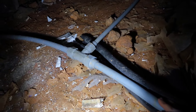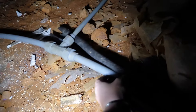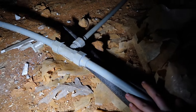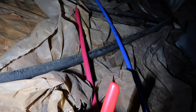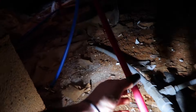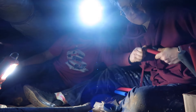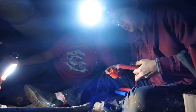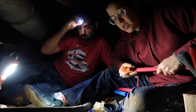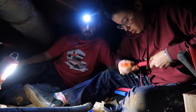This piping is what I have coming from the water heater that was feeding into the copper lines, and it also goes that way towards the washing machine. This is what I'm going to be replacing with the PEX as well, because I've heard remnants of it cracking and whatnot. Currently it was fine but I'm already here doing all this, so might as well just replace it — it's just right here to the water heater. I'm going to do three-quarter inch PEX so I have a bigger feed line in. Right now I don't have a working water heater and I'm going to replace it since I went electric. So we're going to connect the cold and hot water lines together right before the water heater inlet so I can still have water, just not hot water. That's the plan anyway.